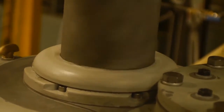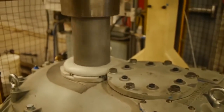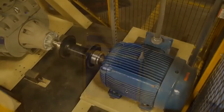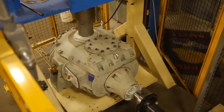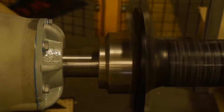The run-in process also allows the technician to check for any oil leaks and serves to coat the internal components with a rust-proofing lubricant to protect the unit during shipping and storage by the customer. This extensive factory dyno testing procedure under load is unique for a gearbox repair shop and ensures that the repaired or rebuilt gearbox will perform to the stringent Marley OEM specifications.